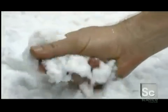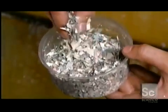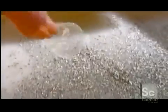After eight hours of beating, workers feel the pulp's consistency. They will then take samples from this batch to make sure it doesn't contain any unbeaten rag or knots. Next, they add colorful scraps of paper to the pulp to create a decorative pattern.